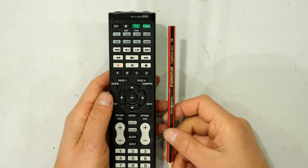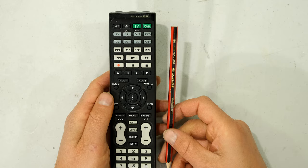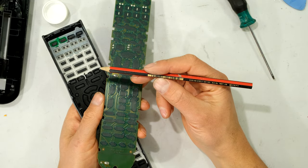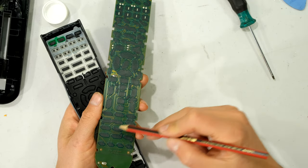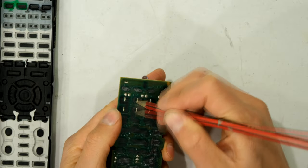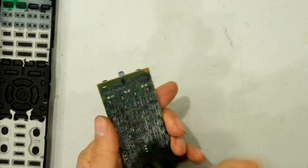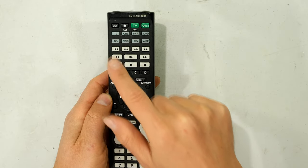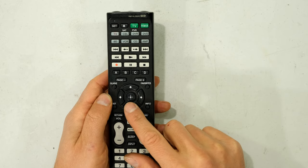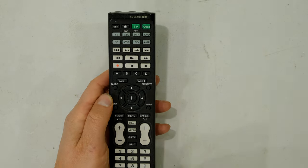If in your case it's still not working, you can use a pencil to put some carbon on the surface of the circuit board to increase the conductivity. Take an HB, 2B, or 3B pencil and color in on the contact pads — that adds carbon to the surface which increases conductivity. When you're done, close it and it should be working like new. Unfortunately, using the pencil is not a long-term solution; it might improve things for a month or two or three, but then you'll need to apply the carbon again. Thanks for watching!